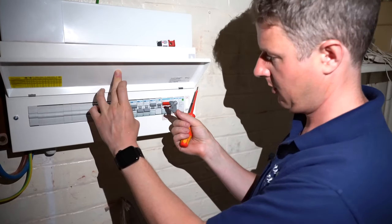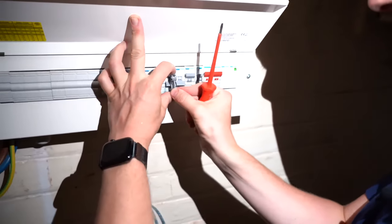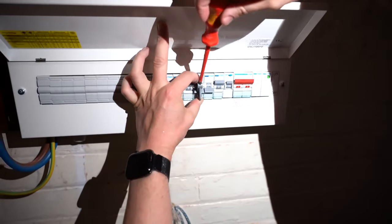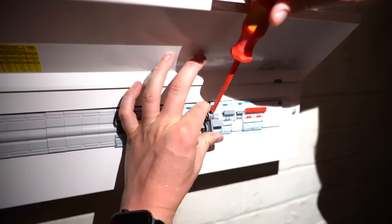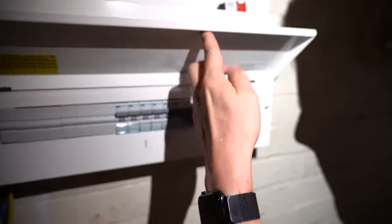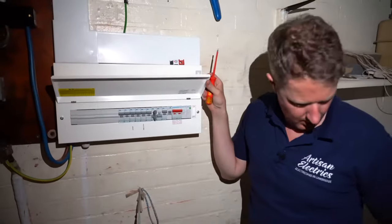It's a lock seven, so it's got a little number four on the side of it as well, and it fits perfectly. What we do is just screw this little retaining screw down like that. That's tight now, so nobody can actually turn that breaker on — now even if I want to, I can't turn it on.